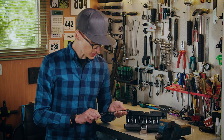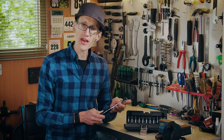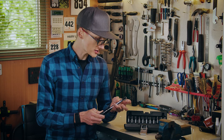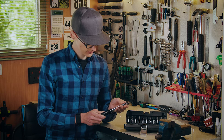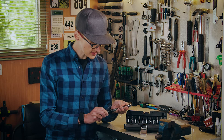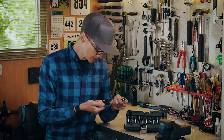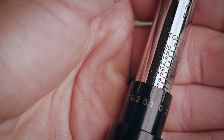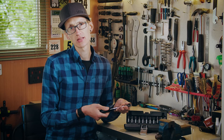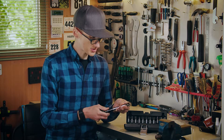Firstly, you set the torque of the tool to two Newton meters and push the head gently from one side to the other, and you will feel a small click as you push each side. When you've done that, you can now set the torque to six Newton meters by rotating the handle. Once you're set to six Newton meters, you carry out the final step of the process which is resetting the torque to two.